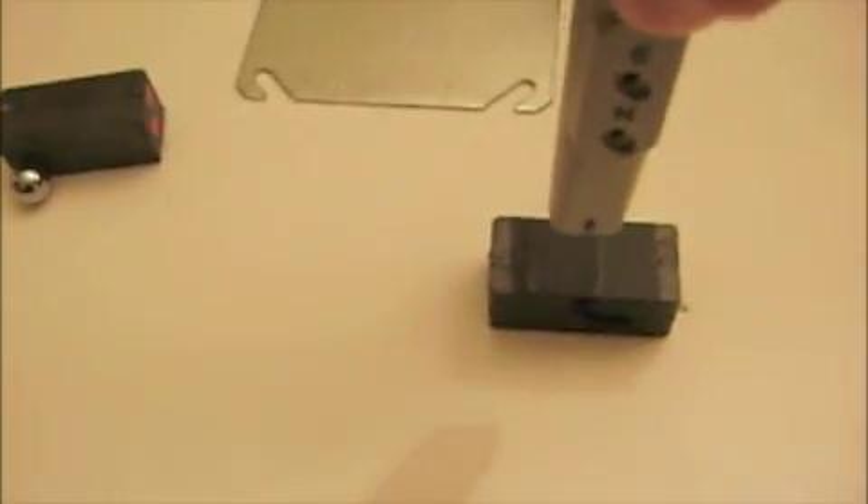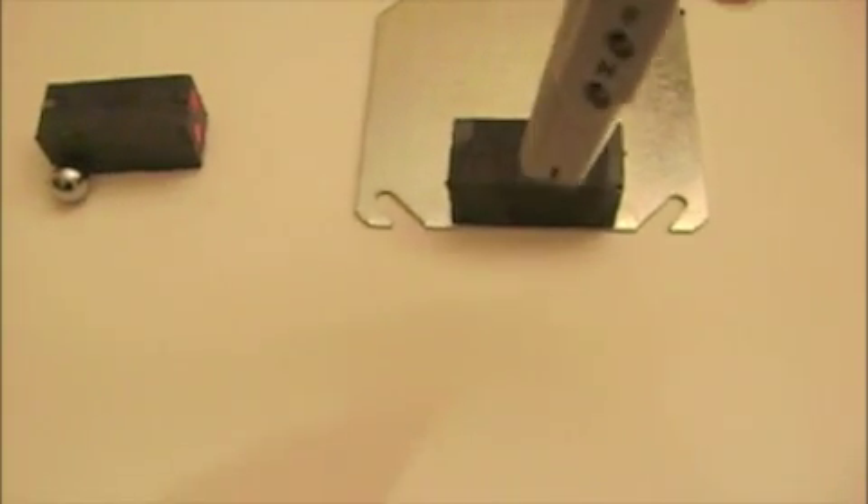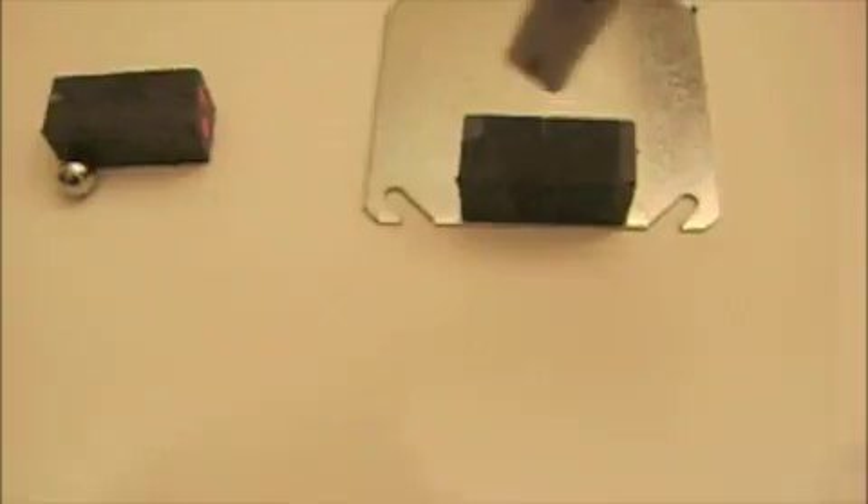And it totally shuts out the south pole on one side of the magnets. You can still get a north on the other side. You can block that out with a little magnetic shielding. You can still get a strong north pole right through the center region. You can see this totally shuts out the south pole on the other side, as well as through the shielded area. So you're only receiving the north right through the center line where the two north poles meet.